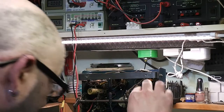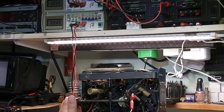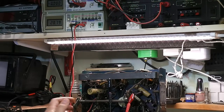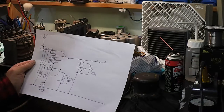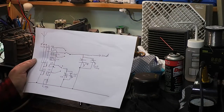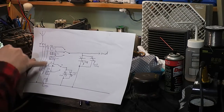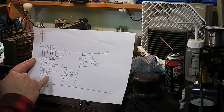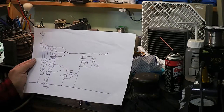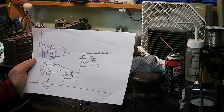I think this one is the other side of the oscillator: 4 ohm, 2 ohm, 0.35 ohms. So I think there's a good chance all the wound components are in a good state — that's good news. Looking at the input aerial input circuit: shortwave just seems to be a straight-through transformer, but long and medium wave have an additional coupling to an additional tuning capacitor. So you've got effectively two tuned circuits — one on the aerial side and one before the grid. That's an interesting circuit arrangement, one I've not seen before. That obviously gives higher selectivity on long and medium wave bands but not on shortwave, which surprised me with a 465 kHz IF.